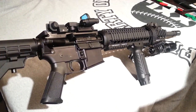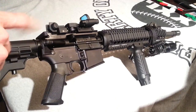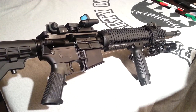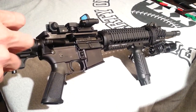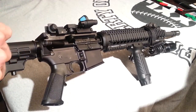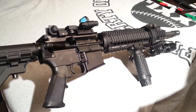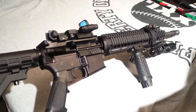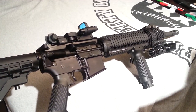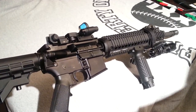It's a 1-in-9 twist. For those who don't know, what that means is for every 9 inches of barrel length, there is one complete turn of rifle grooving, which turns and stabilizes the bullet. Generally, for heavier bullets you need more twist — just like throwing a football, you need a little more torque to stabilize it. The middle of the road is the 1-in-9 twist, which suits your basic 55-grain bullet. The heavier steel penetrator bullet at 62 grains usually requires a 1-in-7 twist for more stabilization.